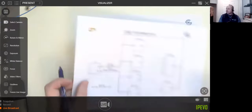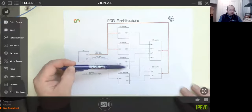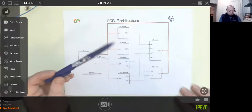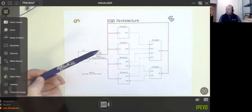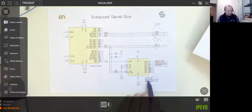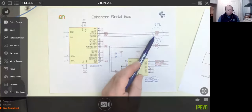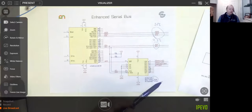And so what we can do as well, just going back to this page here, if we use them both together, all those various interrupts and other features, we can put straight onto the expander chip, and just have a priority read or a priority write address, which would be in your code. The address for this chip, I've got this set to 0x40, is the address for this PCF8574, which is in the downloads. So I would write to this chip to switch on any SPI devices that I want on the other side of the board. I would read to check if there are any interrupts on those chips which I need to service.